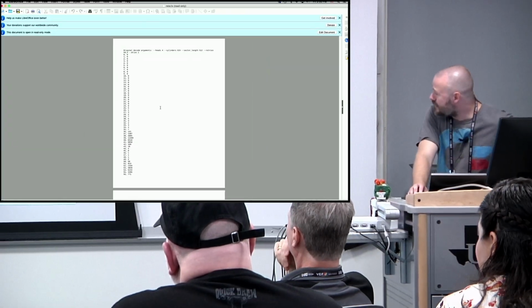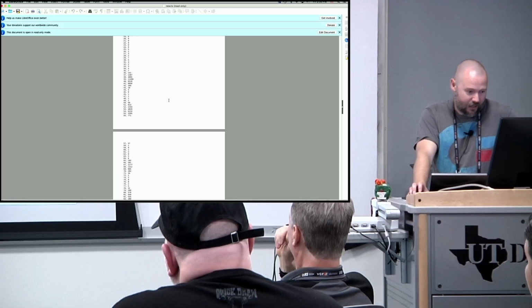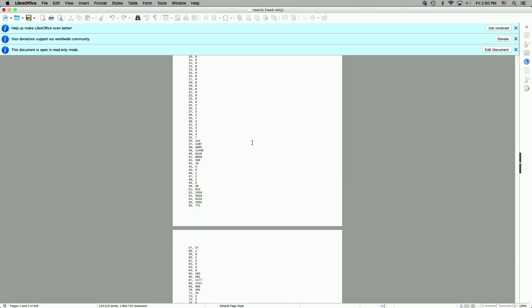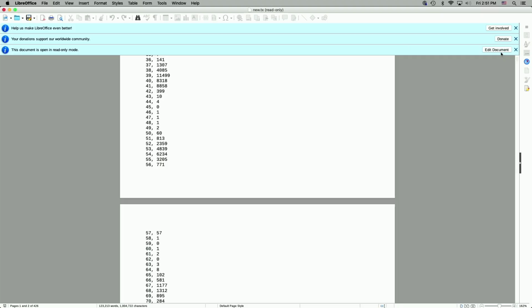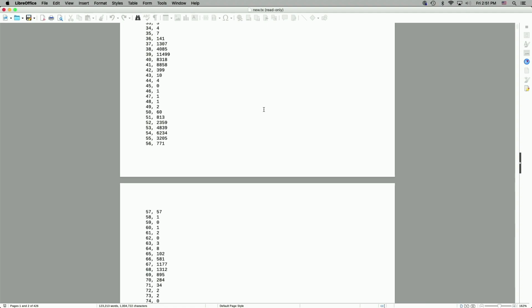There we go. It's very tiny and very hard to see, but this is actually a histogram that I pulled back off of that track, cylinder 50 head 3, the one I was able to get data off of. Let me get rid of these and get a little more real estate here. So you can kind of see as it goes down that there are very well-defined peaks around certain values.